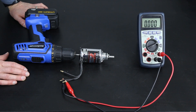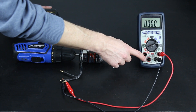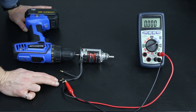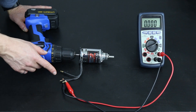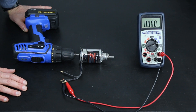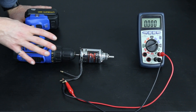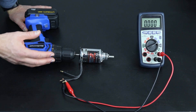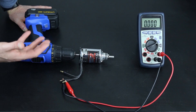Because of that change in process — stopping the motor and continuing again — that's why I want a consistent setup where I know I'll get repeatable RPM values. What I do is take my multimeter using the correct inputs to measure frequency, then connect that to one phase on our brushless motor, which means selecting two of the wires and placing the leads onto those. Then I take the drill and secure the chuck right onto the shaft of the motor. I'm going to use the high gear setting — I want the most RPM possible, around 1300 or more.